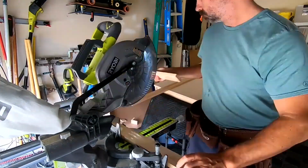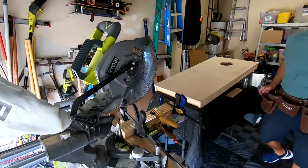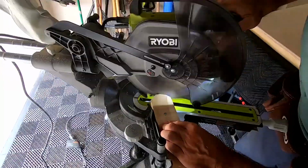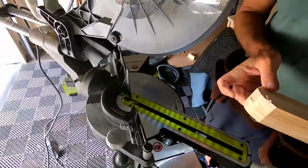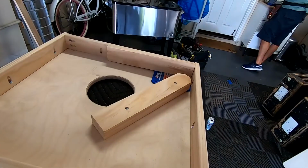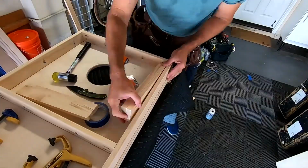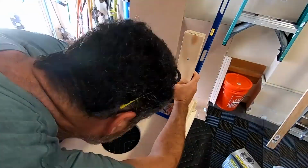For the legs, I picked two 14.5 inch pieces of select pine, glued and screwed them together to create my leg. Now I used a Coors Light can to create the radius template for the round side and used the miter saw to just cut at 45, 22.5, 15 and 0 degrees on each side, which I would then round out on a belt sander. We get our holes in, get our geometry worked out, got to grind down those little screw heads in there so they don't mar my legs.